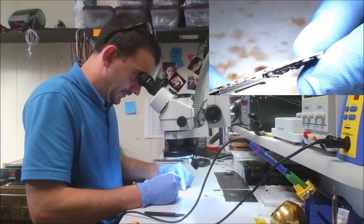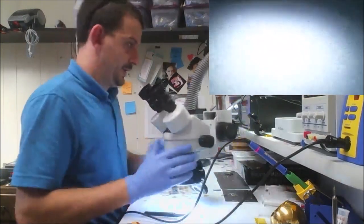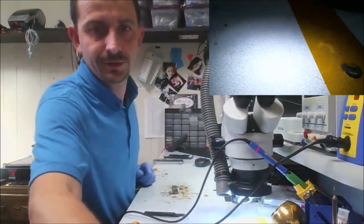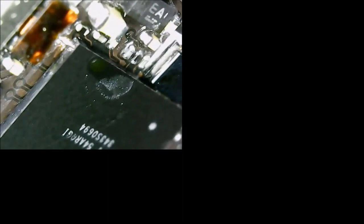Oh yeah, these jumpers actually look really good. I'd be surprised if this doesn't work. I guess for the sake of this video, this is the corner I did the jumpers on. There are two of them there. You can really only see the one, and it looks like crap in this microscope. Looks really good in the big one. But it's a really, really robust connection there at that ground. And the other pin's nice and solid too.